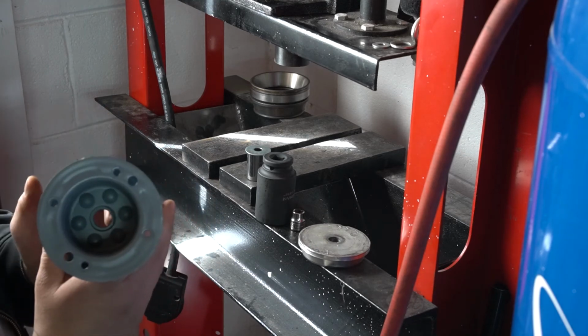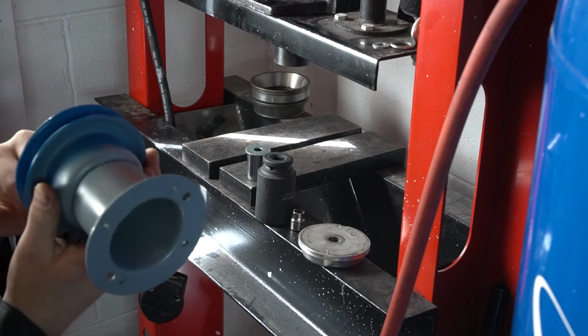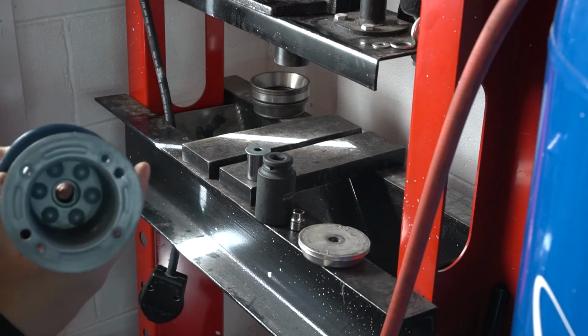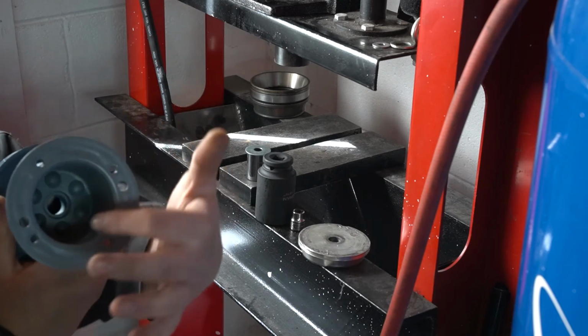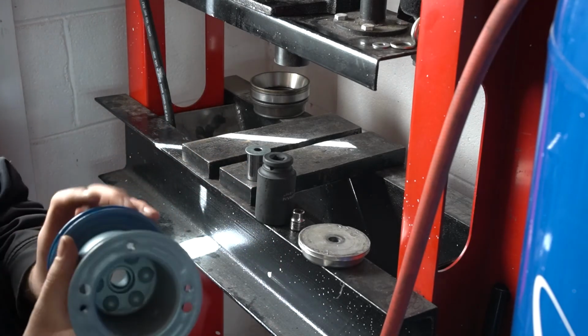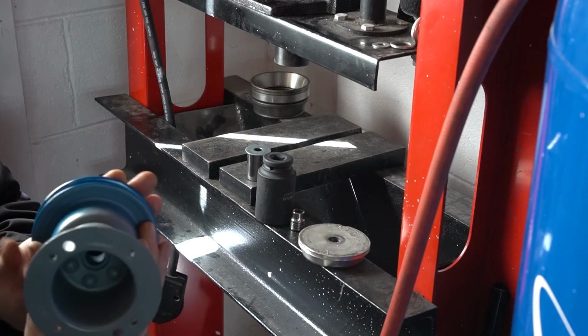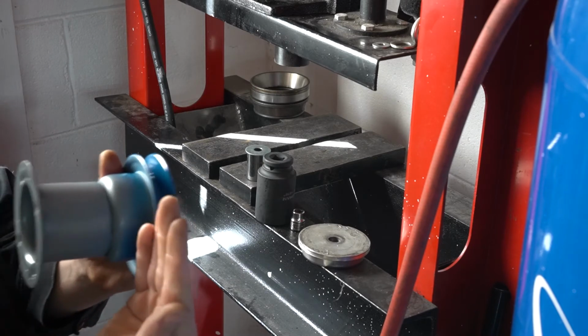When we look in here in our pulley hole, shaft, mount, whatever, this shaft was not all the way flush against this inner edge here. It was down about 1/8 of an inch. So whenever I push this back on, that's where I want it to go back to. Otherwise, our belts will be misaligned.